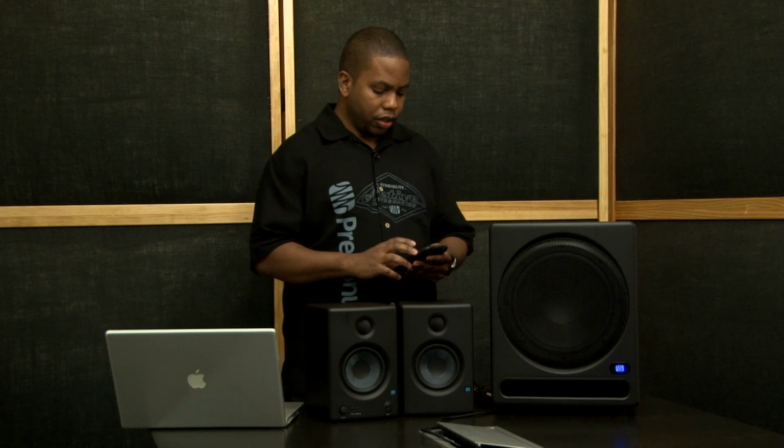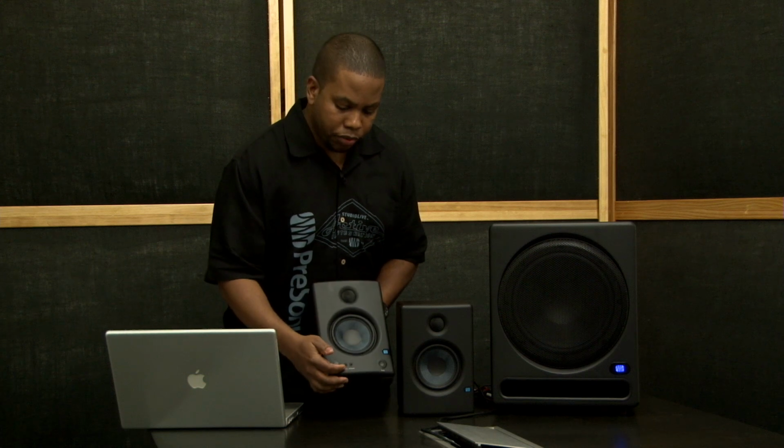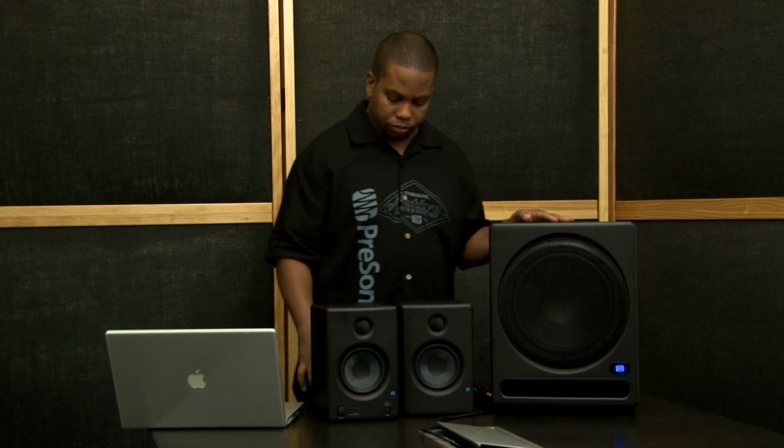There's a question, is it TRS or RCA, or are they combined? I'm not sure if that's for the T10 or the Eris 4.5. On the Eris, the TRS and the RCA, I think they may sum. I know the 1/8-inch input on the front will sum, so you can hear both what's coming through the TRS or the RCA and the 1/8-inch input on the front on the Eris. On the T10, you may not want to do that necessarily. You may want to just use either XLR, TRS, or the RCA inputs.